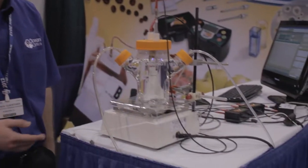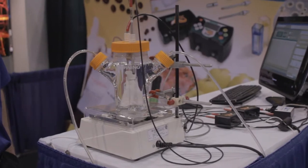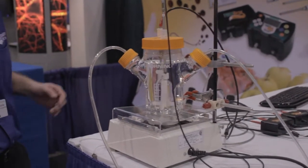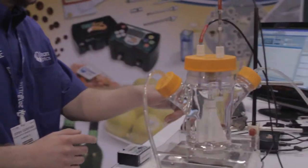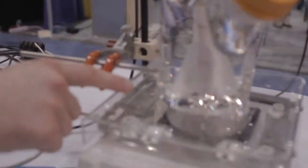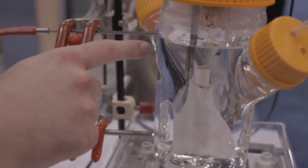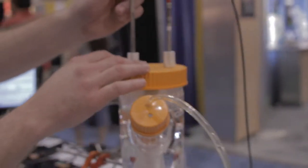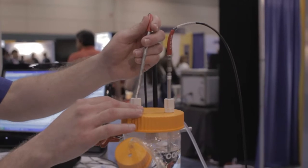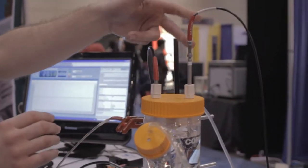We're showing here a bioflask that has both intrusive and non-intrusive measurement probes. If we can take a look on the inside of the flask, we have a pH patch located at the bottom and then an oxygen sensor patch up top, and these same chemistries are also in intrusive probes — such as this one for pH here — that can be swage locked into a process line or vessel, and then for oxygen here as well.